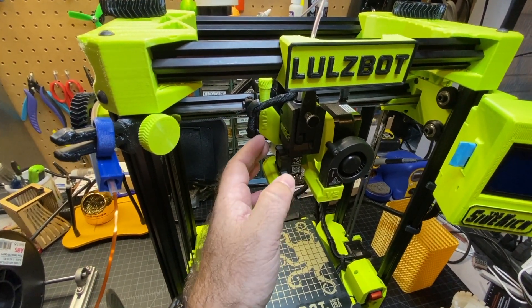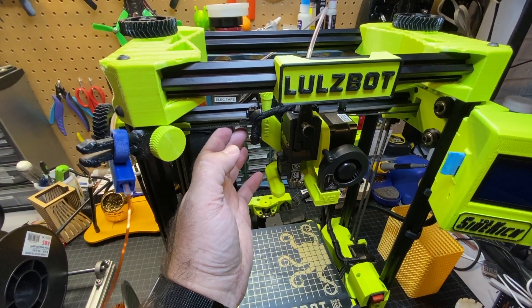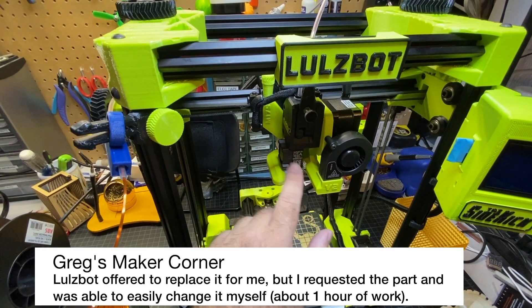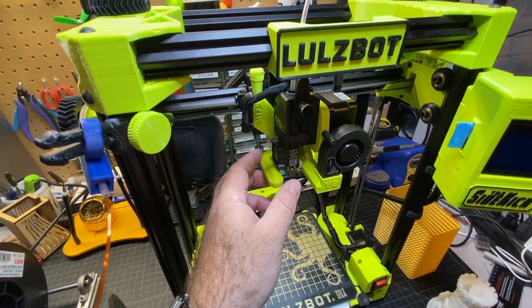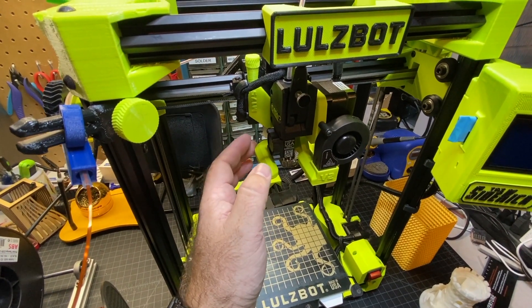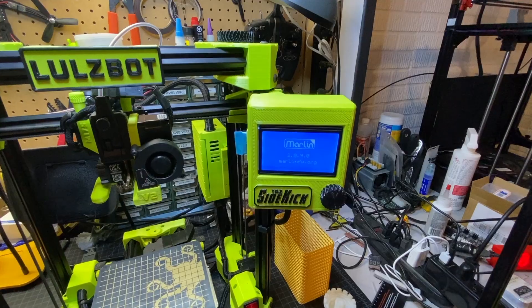Some of the earlier models have already been switched over. I basically just got this replaced recently, probably in the last couple of days. But now they're similar to my other printers — actually maybe even better. There's really no play at all when I push on this. And what that play would potentially do, especially on larger prints and faster printing, is show up as artifacts in your prints, and you definitely don't want that.